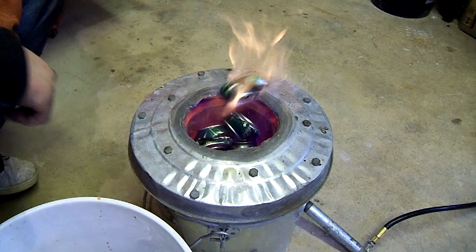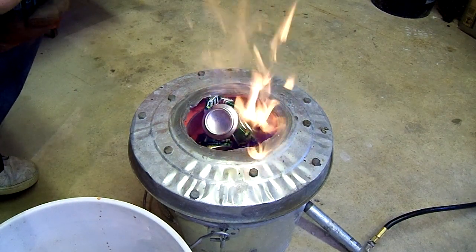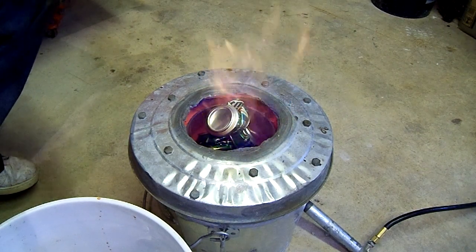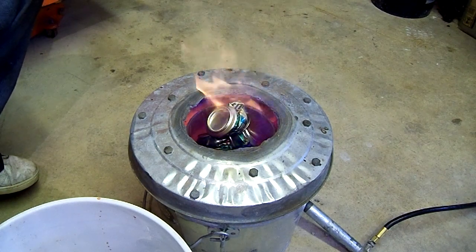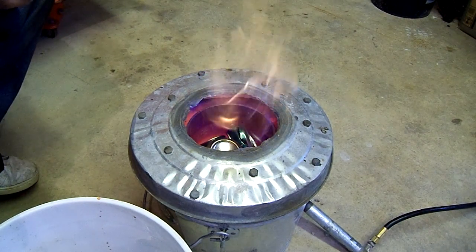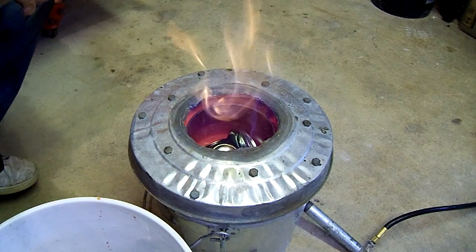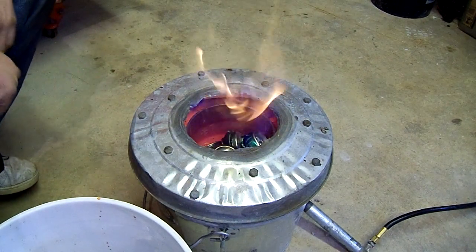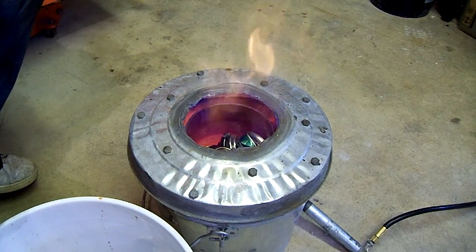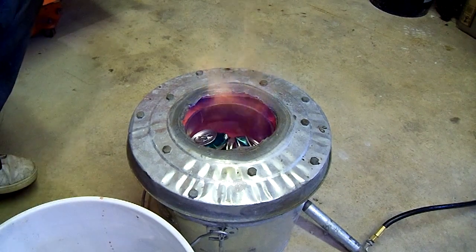I suppose we can discuss other fuels as well. If you guys don't feel like making a propane burner or can't afford one, if propane's too expensive, there are other fuels you can use. There are people who have made furnaces that use waste oil, motor oil, vegetable oil — things like that. Those are neat, and free fuel as well. The only thing you typically have to pay for is a blower motor to help atomize the fuel before it combusts. Electricity is pretty cheap, especially to run a little blower.